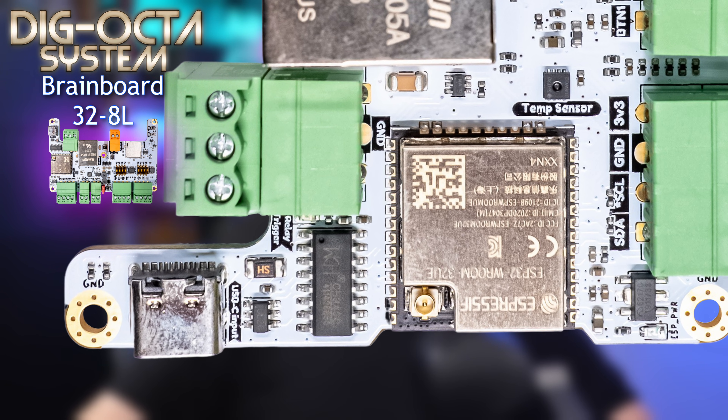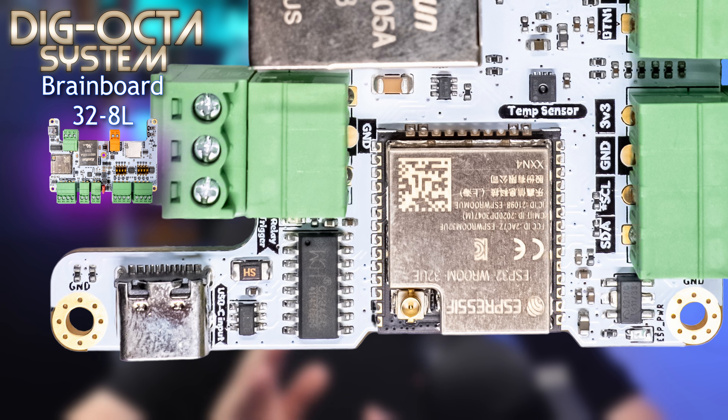At the bottom of the board there is a side-mounted USB-C port, which is the second method supported to power the board. It's fully enabled with USB-to-serial and the auto-program feature for the ESP32. It's also an ideal way to keep the board on standby power when the big power supply is switched off using that relay feature.